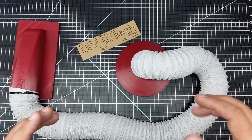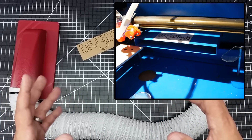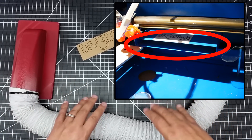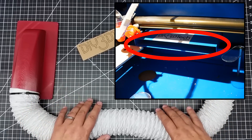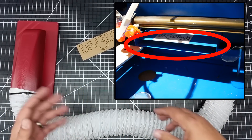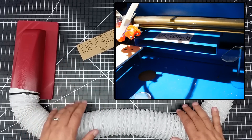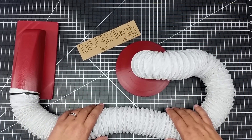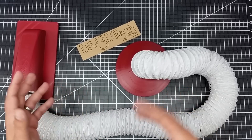The reason I didn't go larger is I wanted to match this up with the vent of the laser. The vent on my laser is about 4,000 square millimeters in size. If you calculate out the area of this hose, which is three inch marine grade ventilation hose, what you end up getting is about 4,500 square millimeters. So there's a good match between what the vent of the CO2 laser can take in versus what this hose can move to the compressor. From this tube into the compressor, I'm getting at least a one-to-one ratio because the output is three inches and my input is three inches, so I'm going to get a good movement of air.